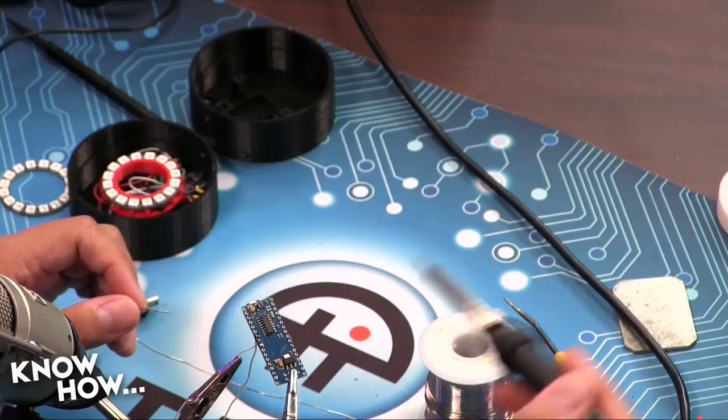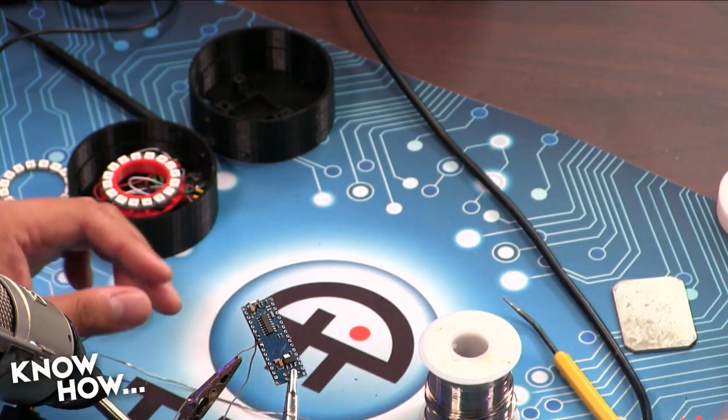It's just free floating. That's why if you've ever tried to directly hook up a button to an Arduino and looked at the input, it will fluctuate. You'll get 0, 1, 1, 1, 0, 0, 0, 1, even though you're not touching anything. So what we need when we're hooking up a switch to an Arduino is a way to maintain some form of current that the Arduino can differentiate between on or off, a closed circuit or an open circuit. The way we're going to do that is by using a resistor.